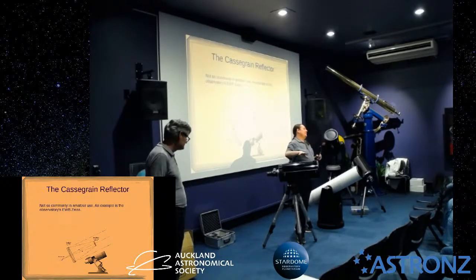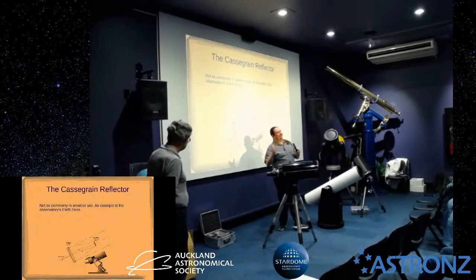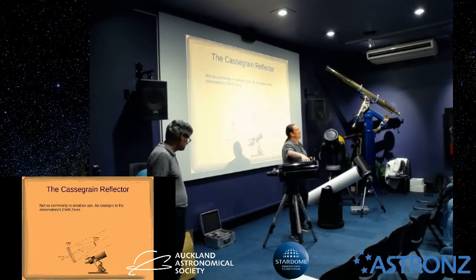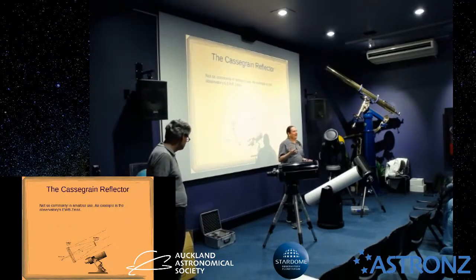If your telescope's mechanically well aligned, then aligning up those circles will help. If it's not, and there's nothing in your optical quality that says it has to be, those mirrors are slightly off, the fact that the tube isn't down the same axis doesn't make any difference. So you can have variable effects with that. So I've seen telescopes which are perfectly collimated, or as good as they're going to get, and you put in the Howie Glatter laser with the circle projection and it looks like it's well off.